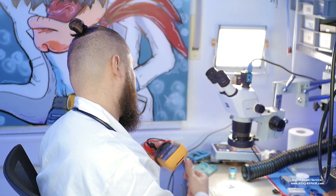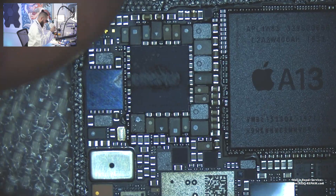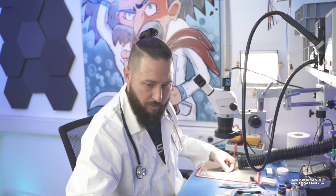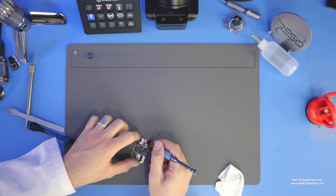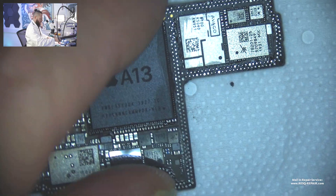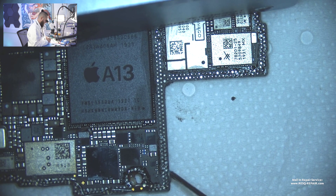What can we do now, Tim? Should we re-ball the board, or should we get it back without a re-ball? I would say, because we want a working phone — it's no data recovery, it's a phone which goes out and needs to be used for a long time. So we just clean and then re-ball. We just take the solder from the top layer board, then from the bottom layer board, and then we start by re-balling the bottom layer — the middle frame on the bottom layer.